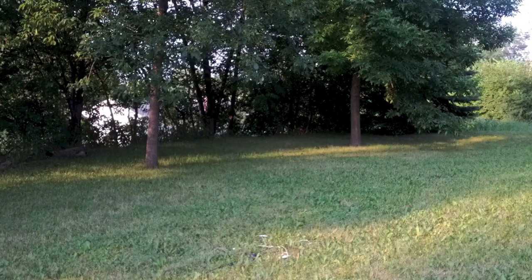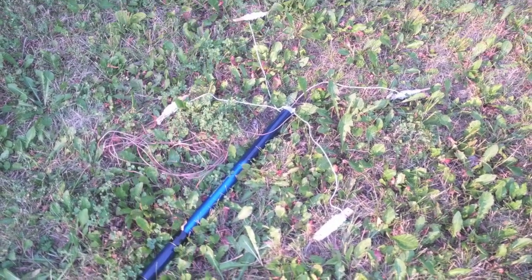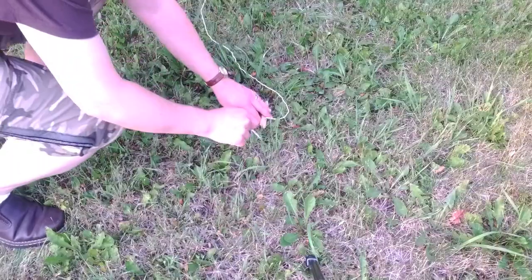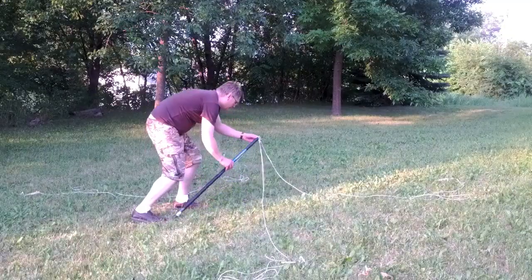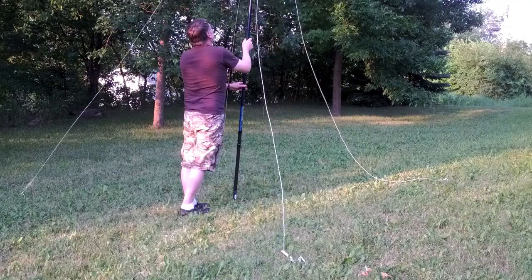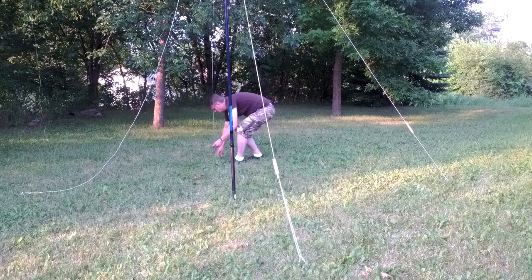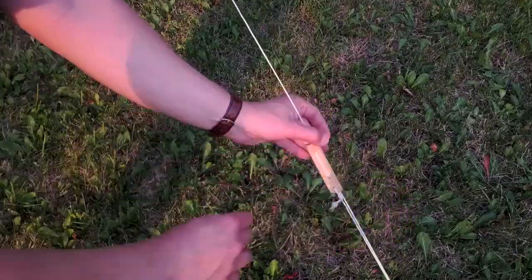Let's get this on the air. First, find a spot to operate away from any power lines. Lay the pole on the ground with the top lying where the pole will stand. Uncoil the support lines and stretch them out from the pole in a big X. Put your stakes in the ground and loop the end of the rope around the stake. Stand up the pole and begin extending the sections, locking them into place. When all sections are extended, the support ropes should loosely support the pole. Tighten each support rope until the antenna stands tall. The sections are locked only by friction, so don't pull the ropes too tight.